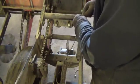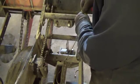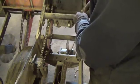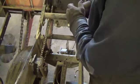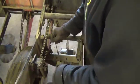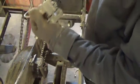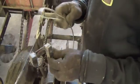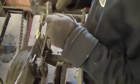We'll undo the wires here. These should actually be wire tied, or normally they have twisty wire nuts on them, but I was having issues with my sensors sensing, so I wired them this way, going through them. About 10 years ago, some would work and some wouldn't. Here it was just the wiring. So here's the sensor removed. Now the new sensor should look just like this, and it'll have ends just like it, and you'll replace it, and then this just zip ties back on there.